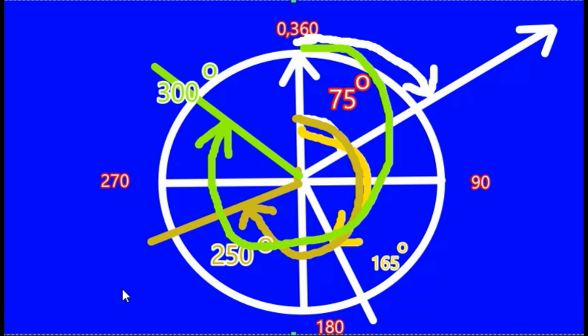When we talk about the whole circle bearing, we mean the whole circle. And when it's a circle, obviously it starts from 0 and ends at 360 degrees. So this is the whole circle bearing. Now we are going to just change the perspective and come back to the reduced bearing section. I hope this is clear, and then we'll be converting the whole circle bearing into reduced bearing and reduced bearing into whole circle bearing. And I'll give you one or two short little problems. You will have to solve it and just answer me. So I proceed ahead with it, and I can assure you that you will be masters in surveying, and surveying is one of the heart of civil engineering. Without mastering surveying, you will never be able to be a successful engineer in life.